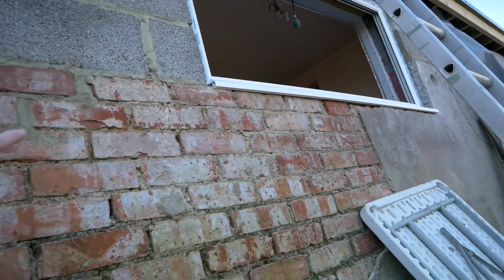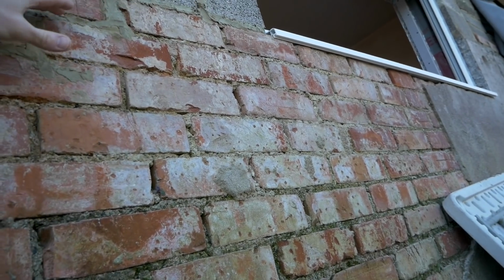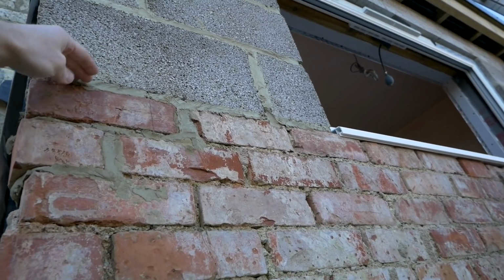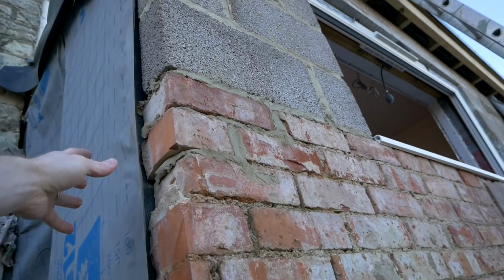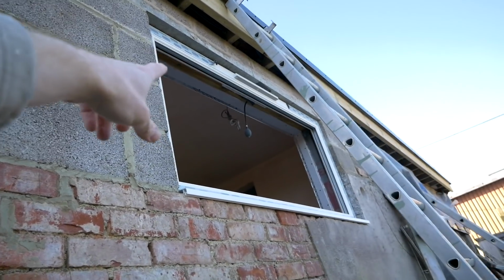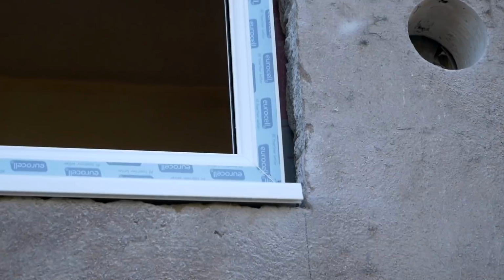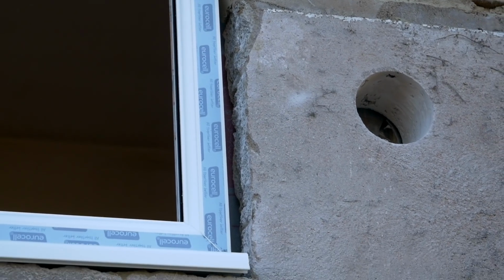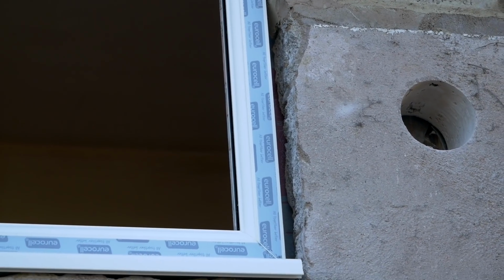Yeah, you can have a look at our blockwork. So this is obviously the old brickwork, and it gets pretty ropey when you start knocking around lime mortar, so we actually took down the rest of this corner down to a level and started again. And then we put a starter kit on this post here and then tied it into the timber, especially along the top there. That's where Dad got a little bit heavy-handed with the SDS, so we've taken out a little bit too much there. We'll have to sort that, but again, by the time we put the bead down and render, that'll be rectified.